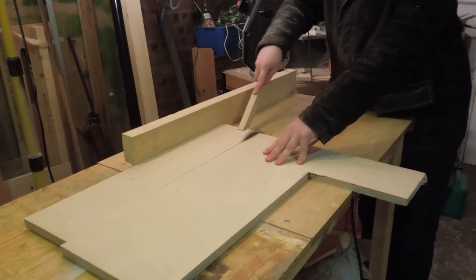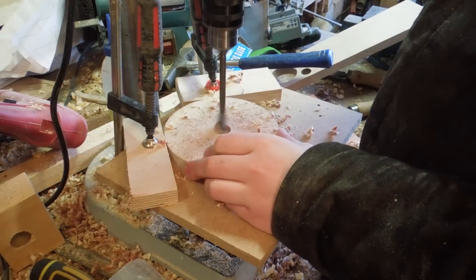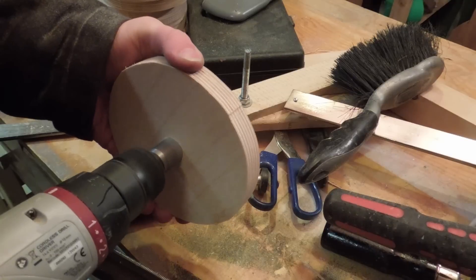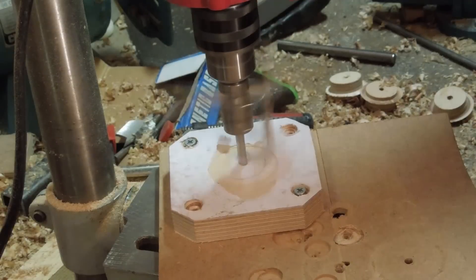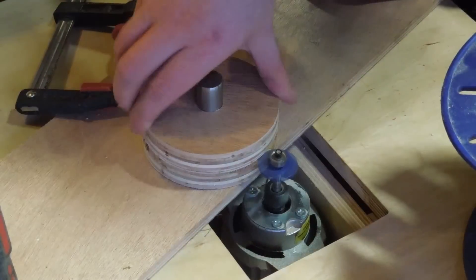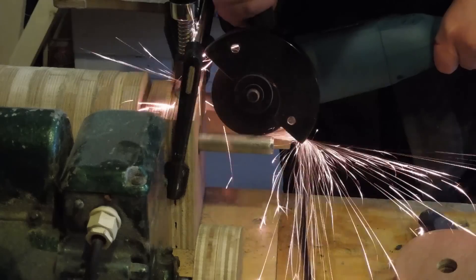The drum was made similar to the conveyor rollers, only bigger. The 20mm spade bit I had was a fair bit undersized, so I made a reamer by hacksawing into a bit of steel the same size as the drum spindle. The two end discs on either side weren't glued and were screwed on so I could take them off after turning. Two bearing flanges were made using the hole cutter I had made, and the bearings were epoxied in. I also made a pulley using a questionable setup on the lathe — I wouldn't recommend doing it this way. It would probably be better to make a rough pulley to turn the fancy one on the spindle. An angle grinder was used to cut a rough keyway into the spindle.